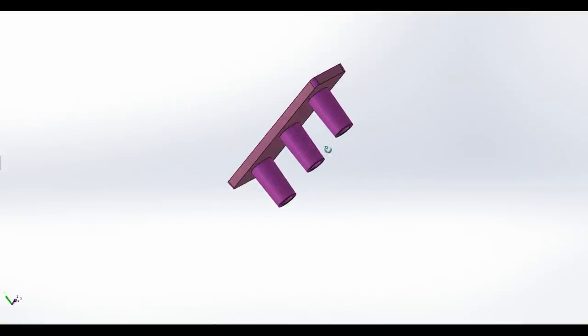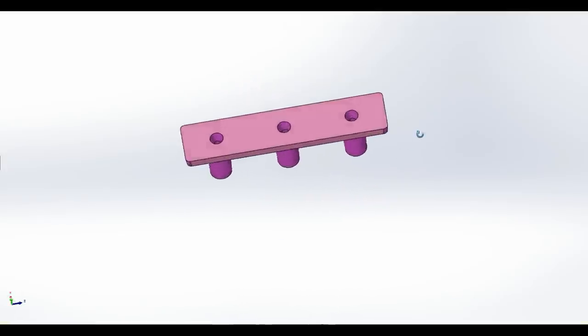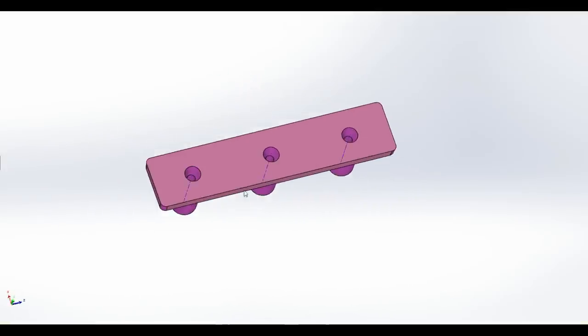And the other one, which is color-coded green, looks very similar to this. So we're just going to look at this pink-purplish one right now. So in the CAD system, one thing you got to do is increase the scale factor, because plastic shrinks when you mold it in the mold. So you got to make your model slightly bigger.